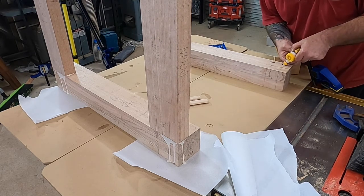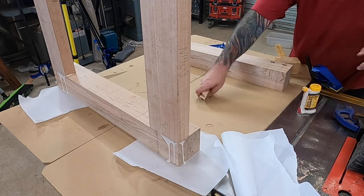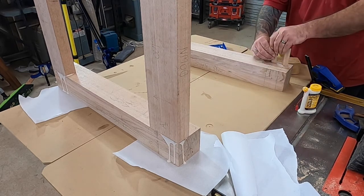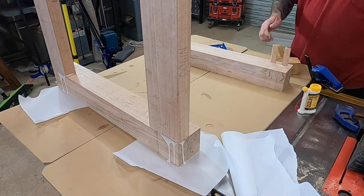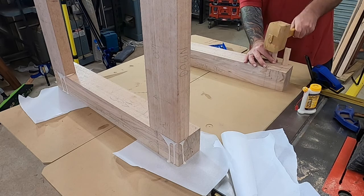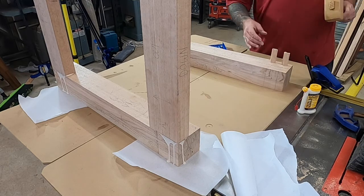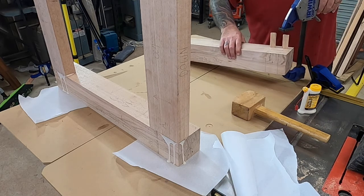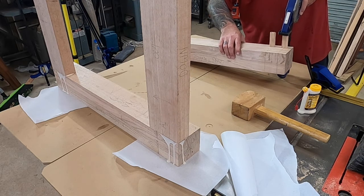So I've got a bit to prepare for the middle frames because I am putting two stiles in the middle of the workbench just to keep the unsupported area to a minimum, and also it's a good place to store things like bench dogs. I am putting spreaders in to make sure that the long rails don't bow in or bow out or do any strange behaviours.